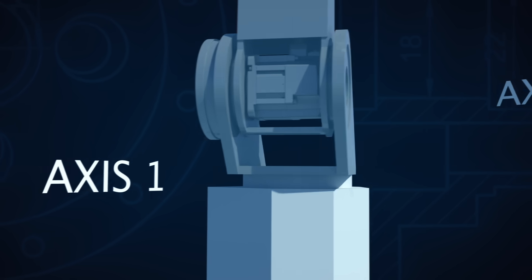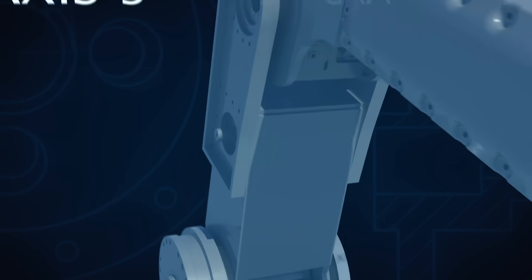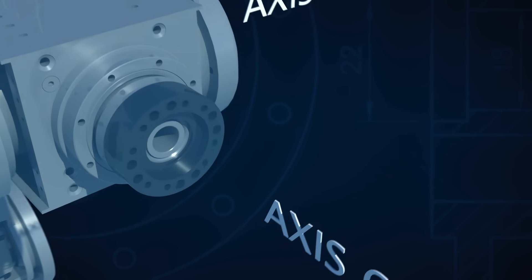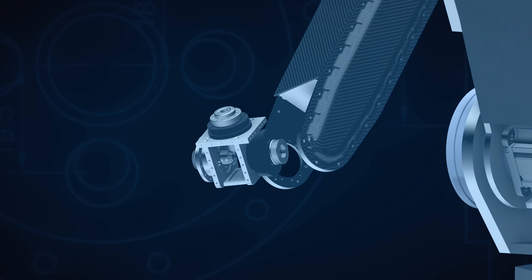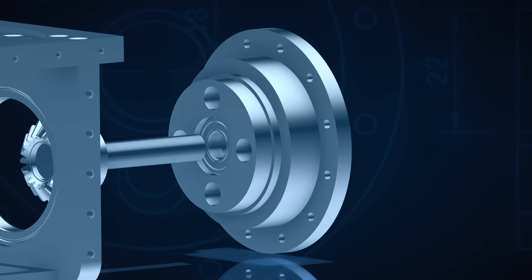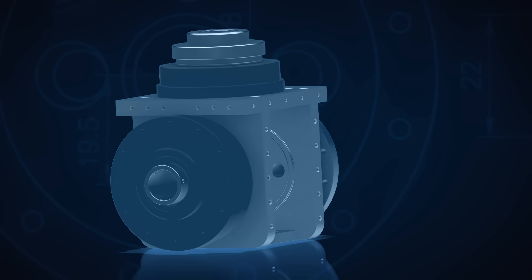We'll begin at the wrist. We can break down a robot arm by the number of axes — basically the number of rotational points. In our case, we're building a six-axis arm, which not so coincidentally is pretty much exactly how a human arm is built. And this all ends at the wrist. Though it might be the smallest assembly in the robot, there's actually a lot going on here. Because of physics, weight at the end of the arm is bad, but the wrist still needs to be rigid because a floppy camera is no good. The assembly contains two out of six total joints in the robot.